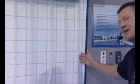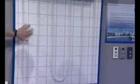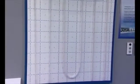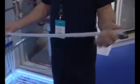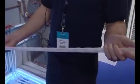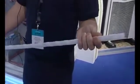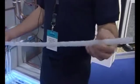There's a new system launched in Germany a few years ago that Uponor have started to bring into the UK. It looks a bit like Velcro. It's a different type of insulation that you lay down on top of the floor construction, and the pipework is laid and fitted directly to the insulation. The stapling method is always a two-person fix — one person rolling the pipe, the second person stapling it. But the Velcro method is a one-person application.